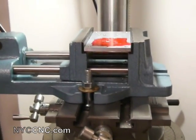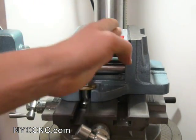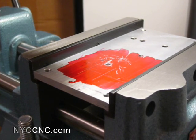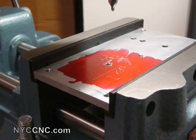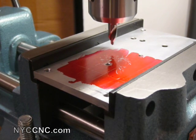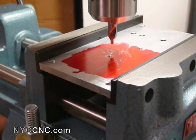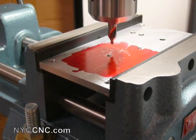That allows you to secure your part down. Obviously the advantage over a screw vise is that you can move from small parts to large parts quite easily. Now that I've got my part chucked up, the cool thing about the XY table is that I can hold the drill press down and then use the XY table to simply move over so I've got my part centered.